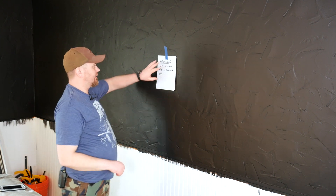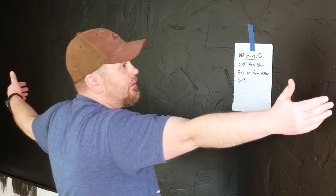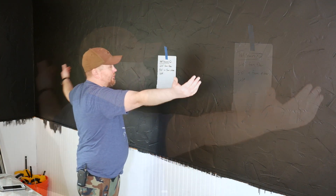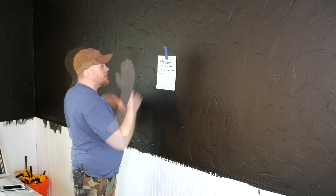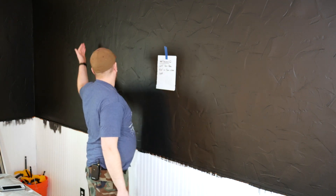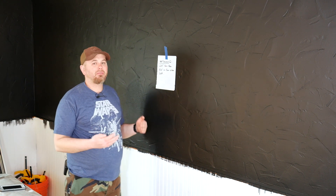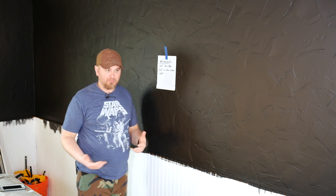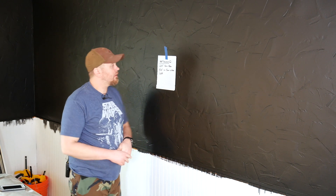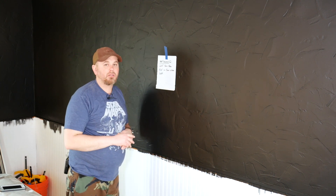For the wall sconces, this wall section is about 13 feet. We're going three feet in from each corner and six feet up from the floor. At first we thought maybe we should mount them equally spaced from either end, which ended up being four foot four inches in, but sometimes when you have things perfectly balanced like that they don't look great. Having things just a little bit off center adds more character, so we pushed them out to three feet in from each end and six feet up.